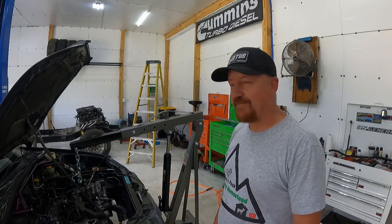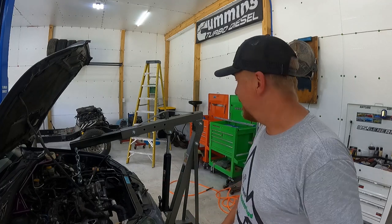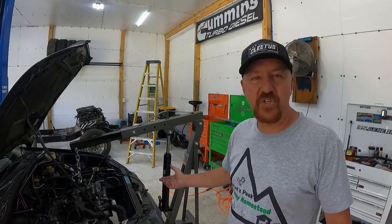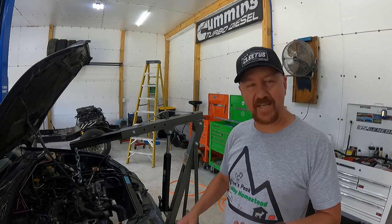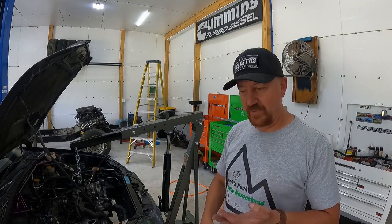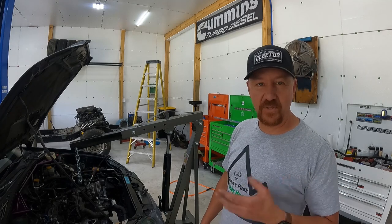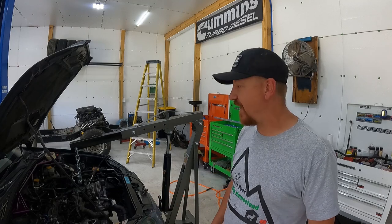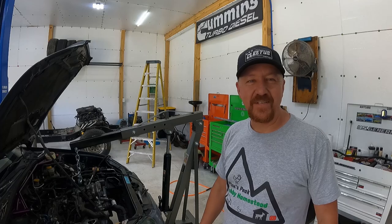Make sure you keep an eye on our content - we'll be putting this thing to use and I'll give you an update on how the engine pull goes. Hope you guys enjoyed the video and maybe this gets you prepared to put together your own shop crane from Harbor Freight. Tools you need: 24mm socket, 22mm socket, impact wrench and ratchet, 14mm socket, 14mm wrench, and 7/8 and 15/16 wrenches if you don't have the metric equivalents. Have a good day!